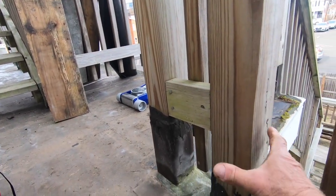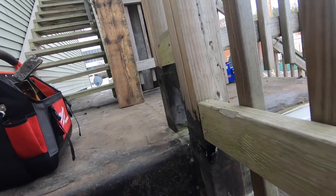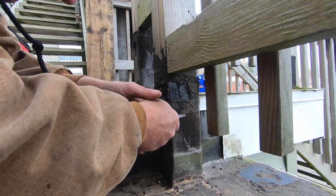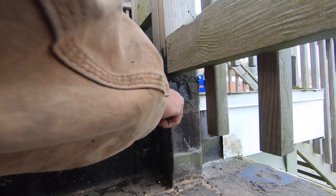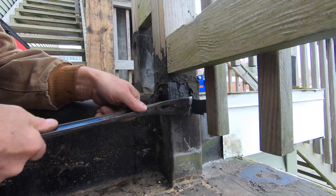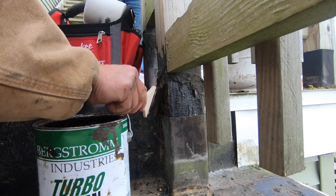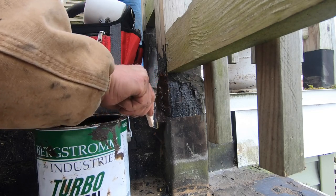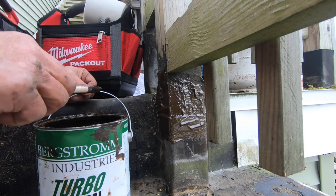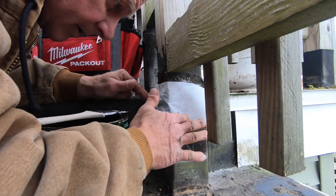This is just a bare column. There should be a sleeve over this and a cap on top of the sleeve, but in this case it's not. So how do you fix this? The tar — you can see the tar is cracking up and breaking. I'm going to cut this away like this, cut it like that. This sticks to asphalt, to metal — this is unbelievable. I can make an easy repair instead of tar. Tar is not going to work. Never.